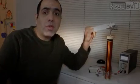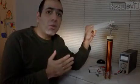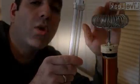Yes, there is high voltage here, but it can only deliver very little current, which means that it cannot maintain its high voltage if more current is drawn. If I bring my hand close to the coil, even without touching it, some of the energy is absorbed by my hand, which causes the voltage to drop — so much that if I touch the coil, the voltage drops to zero from thousands of volts and the light goes out.